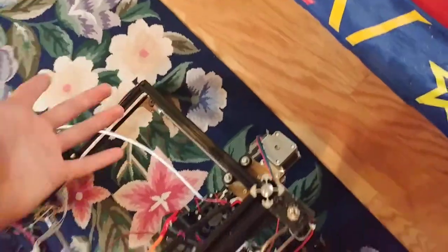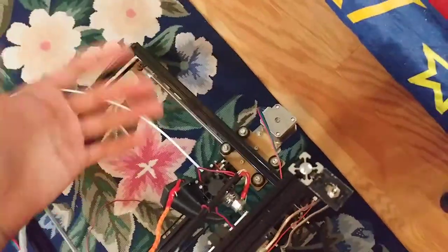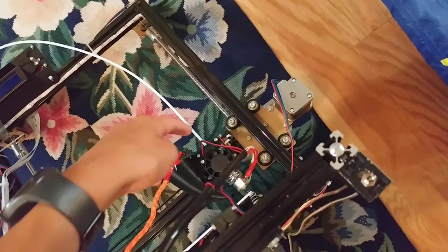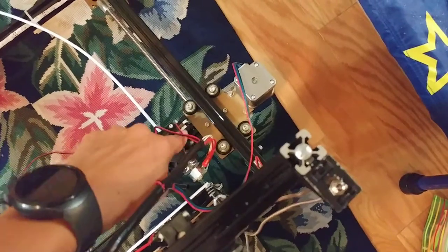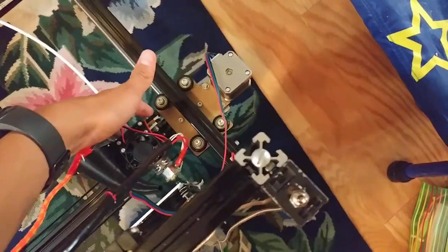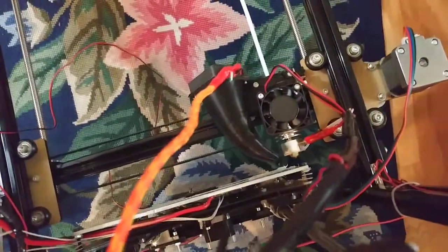It's not hot-swap — well, it's obviously not hot. It's not easy to swap. I have to take out this whole parts cooling fan and hot end fan assembly, as well as the hot end itself, and that's four screws that are all a little bit hard to reach. But anyway, I just converted it back from the laser by doing those four screws, and I was happily printing on it.